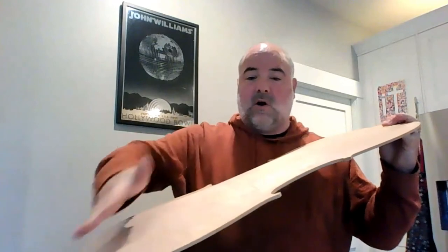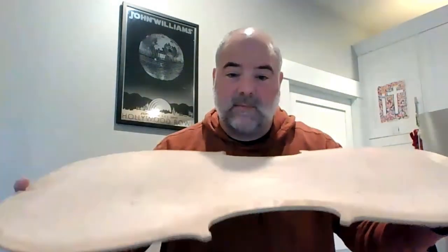Currently, what I'm working on is the back. I started this 20 years ago but hadn't done a lot on it yet. You can see it's very shiny, and you can see the wood grain in it. I had to finish arching this by hand, using a lot of the scraper and planes to remove material. Now I'm doing what's called graduating — you can see the inside is scooped out. I'm starting to scoop it out. I've done most of the work, but I have a lot left to do. I'm going to show you what that looks like — I'll tilt my camera down.